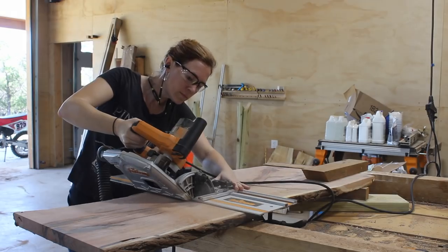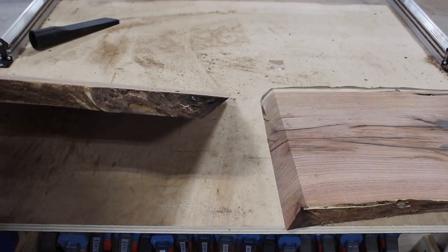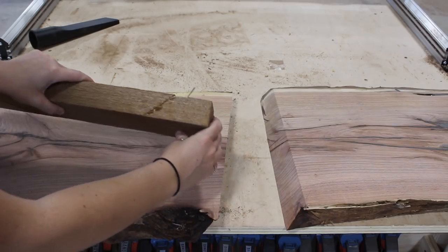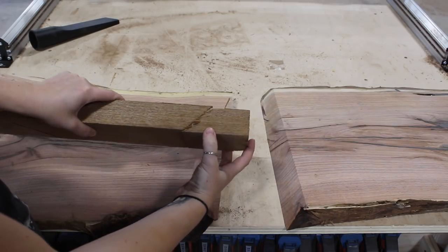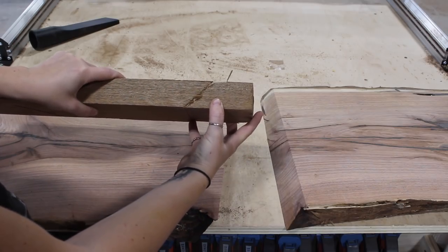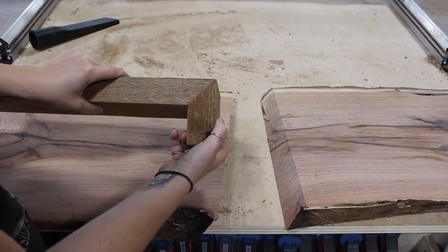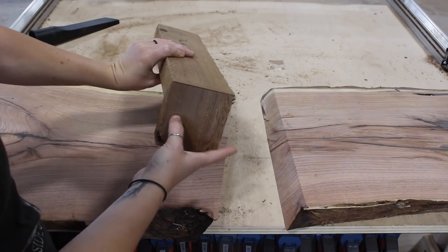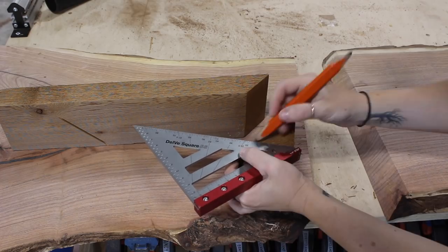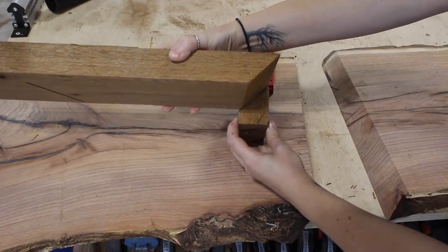This part confused me when I was looking into this process, so I made a visual reference. This is the one 45-degree cut I just made. If you take the off-cut and rotate it 90 degrees you can see that the miters don't meet up - you would have to flip it around, but then you mess up the flowing grain orientation. So I have to make a second 45-degree cut to remove the triangle piece so that it will meet perfectly to the top.